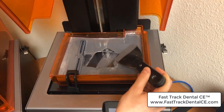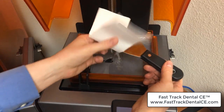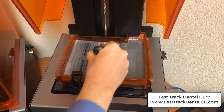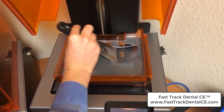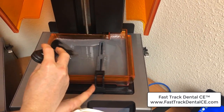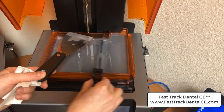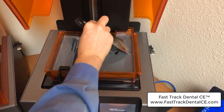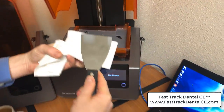There's a little tiny piece of resin — I just take my spatula, come up underneath it, grab a multifold towel, and wipe it off. Then I peel it down, peel side to side, and make sure I can see the clear PDMS silicone layer underneath. I take my wiper blade, move it from side to side — you can really tell a lot about a printer just by the noise. If you hear a thump-thump-thump, something is wrong; it should just be a clean mechanical noise. Then I'll take this to my back laboratory washing station.